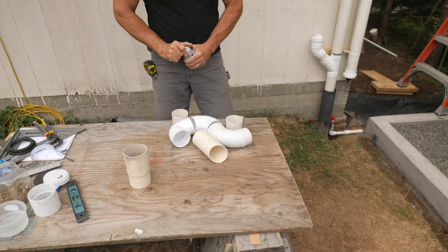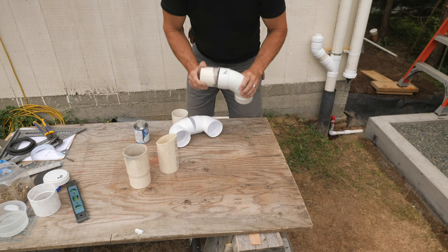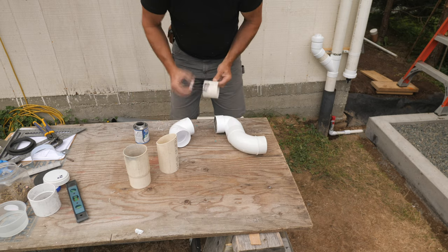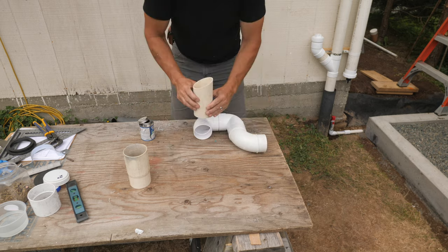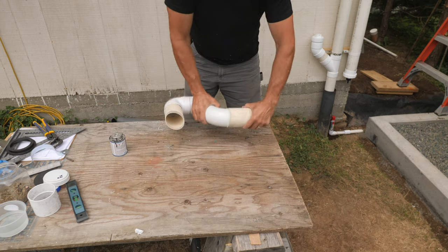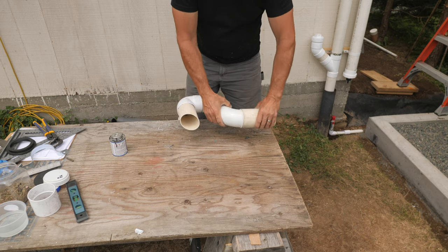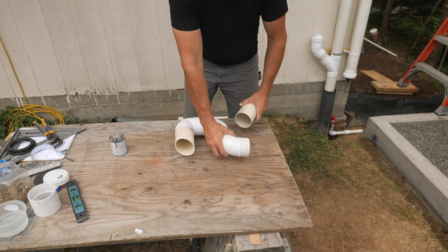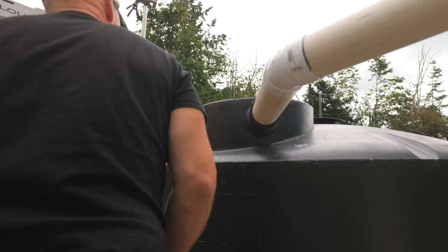For the tank overflow I'll use standard fittings to create a siphon. It's a series of 90 degree elbows and an angled pipe. When the tank is full this siphon will skim water off the surface and send it down a pipe on the side of the tank to the drain that runs out to the ditch on the road. On the other end there's a screen to keep mosquitoes out of the tank. You can buy a siphon formed from one piece but my supplier was out of stock — I think it might actually be cheaper than making your own when you add up the cost of all those fittings.